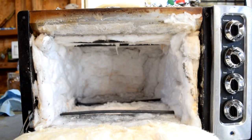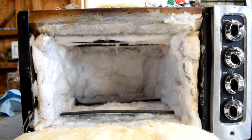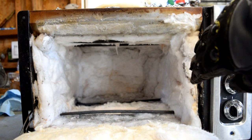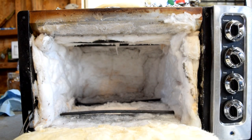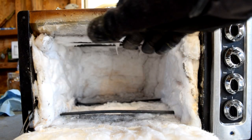The first thing I did is I had a bunch of leftover 1-inch ceramic fiber insulation that was left over from the smoker foundry build. If you haven't seen that video, I'll leave a link up over here. I just simply lined the inside of this toaster oven with that using sodium silicate, which I also had left over. You can get it on Amazon. I'll leave all links in the description. I literally glued the fiber insulation onto all sides of the toaster oven, including the glass front. And there were some grills that covered these elements, and I removed those as well.